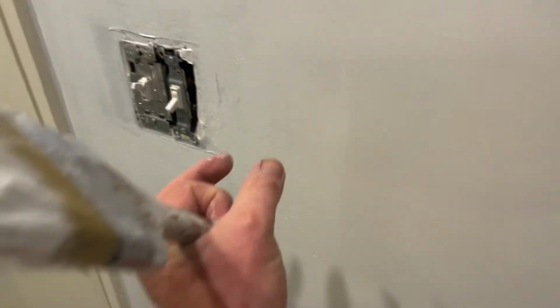Okay, now I'm just putting liquid over liquid here. That's all I'm doing. So my bubbles I can brush away, as you see me doing here. But if you and I were to put our wall covering over this, you would agree that those air pockets would manifest themselves into a nice big bubble here and over here if we didn't anticipate them, right? So we want to let this dry really well. And that's all. They come out nice and easily.